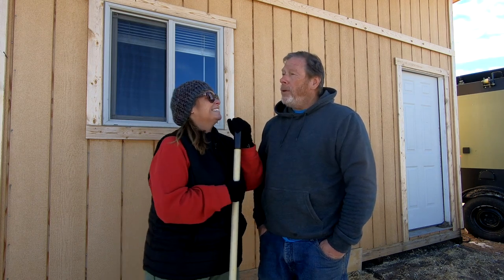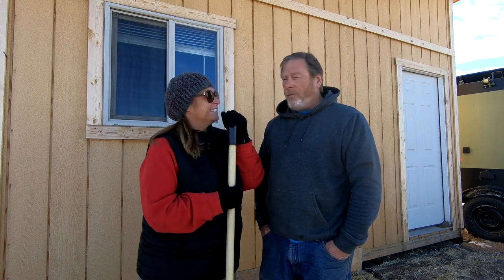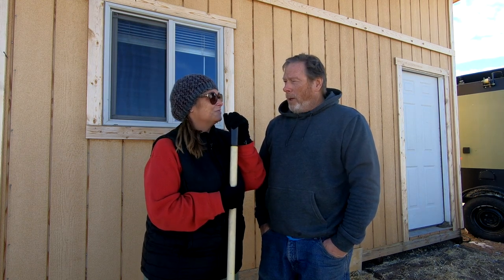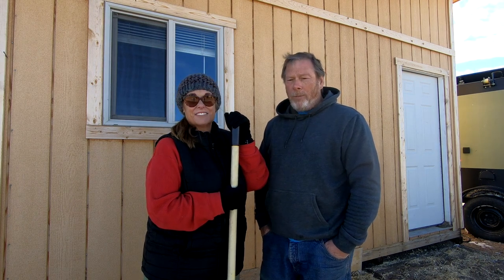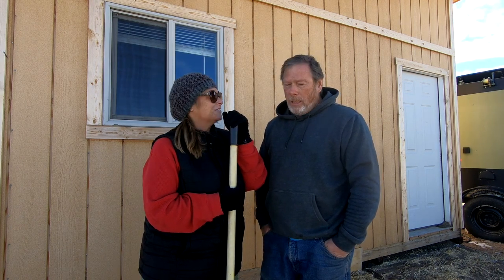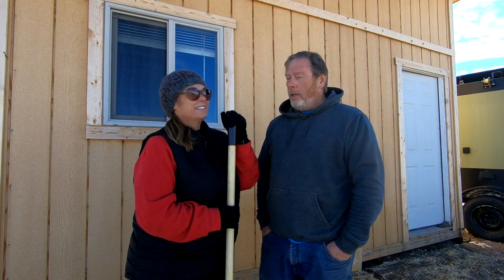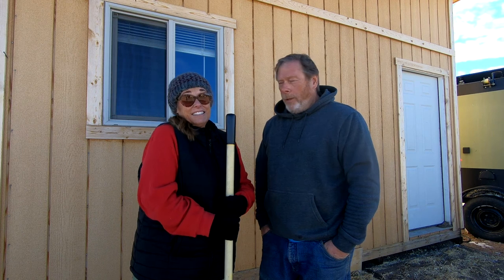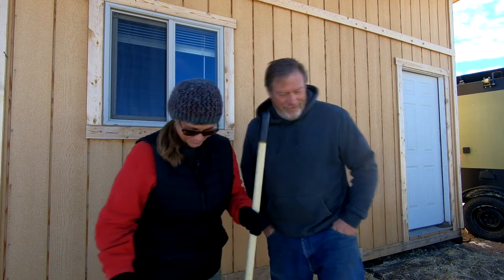Well, we have 10-foot posts. They're going to be sunk 2 feet in the ground, and that means 1/5 of the length of the post will be in the ground, which is sufficient to hold the post. You pack it real well, stuff like that, you'd be fine. Besides, if you put concrete in that shallowly, it'll frost heave. Yeah. So, anyway. Okay. Let's get on it.